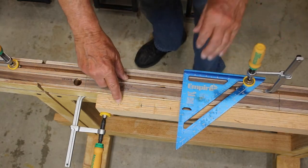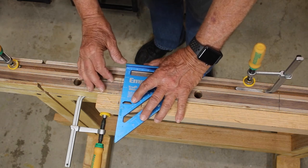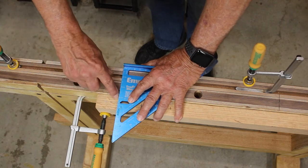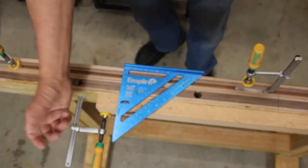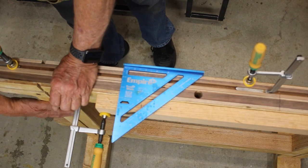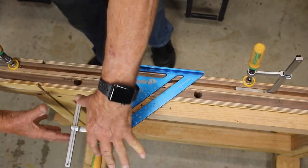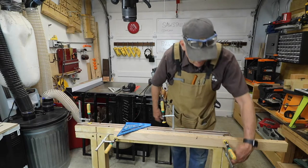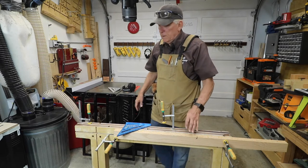This line is where I line up the beginning of the mortise, so I can use a roofing square or a speed square and line it up to my index line, then see if I've got that lined up perfectly with the beginning of my mortise. Once I get that set with my clamps — the beauty of clamps is I could either be using the leg here or I can use the slot here. In this case I needed to use this slot because this piece is not over the leg, so that gave me an alternative. On this end over here I couldn't use the slot, so I used the leg — lots of capabilities.